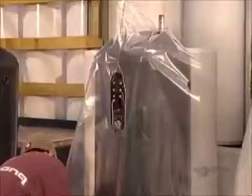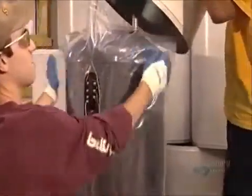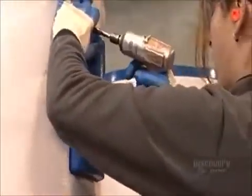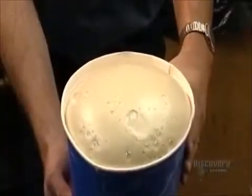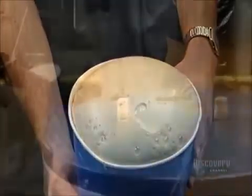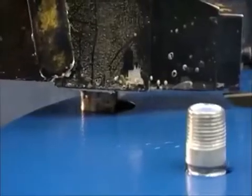Here, they drape a plastic apron over a tank, and then slide on its jacket or tank shell, with just the electric components exposed. They screw a steel cover over them. A chemical reaction causes polyurethane foam to expand in seconds. They inject this expanding foam into the plastic apron that's now between the tank and outer shell. The foam will insulate the tank.